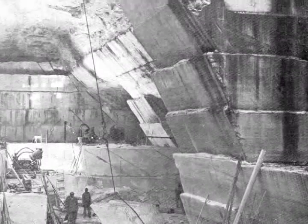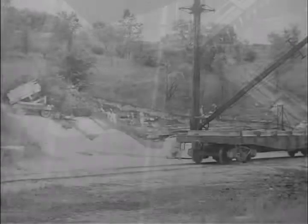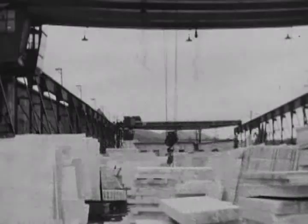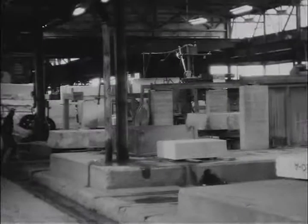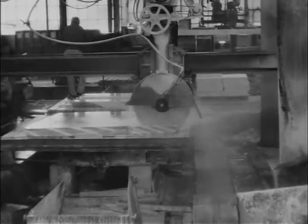The stairway leads to a large underground chamber supported by massive pillars. The chamber branches into galleries which follow the marble deposits. Stone, taken in blocks of 25 tons, is lifted to the surface in the bucket of a crane. They are taken by rail to mills with overhead gantries equipped for the heavy loads. The marble is cut into slabs or blocks with diamond-toothed saw blades or wire saws.